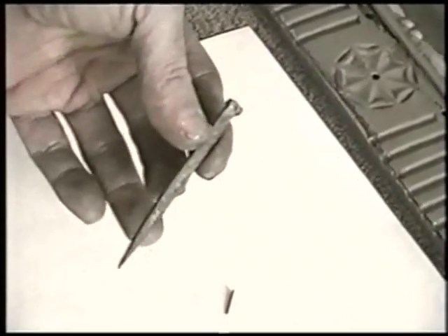They literally took rocks from acid bogs out in the western part of the state and melted them in forges, and would skim the molten rock away from the iron because they're different specific gravities, so that the rock would actually float to the surface in a pool of molten rock. They could skim away most of the rock, leaving just the iron ingot in a hole in the ground. That would be further purified simply by pounding it thousands, tens of thousands of times, compressing the iron molecules closer together, driving more and more of the rock to the surface.